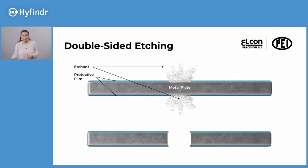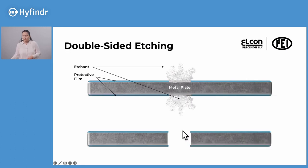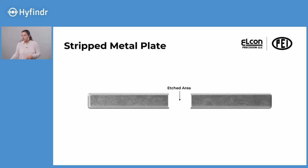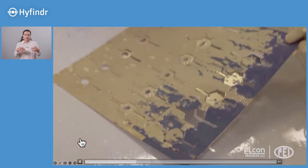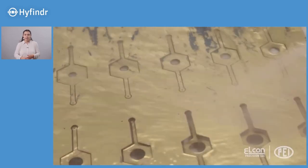You have the ability to etch one side or both sides, and you can control the depth. With single-side etching you can go all the way through or just to a certain depth. With double-sided etching you can etch all the way through so the channels meet and you have a hole in the panel. After etching, the next step is stripping. The etched plate no longer needs the protective film, so it gets dunked into a tank of a strong alkaline solution that dissolves away the remaining blue film. When agitated with the sprayer and rinsed, it washes away from the metal surface and you're left with your finished piece.